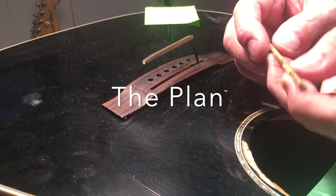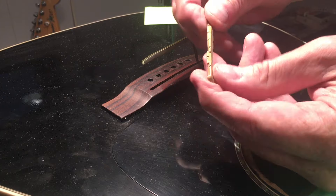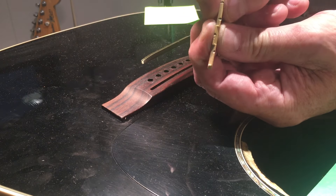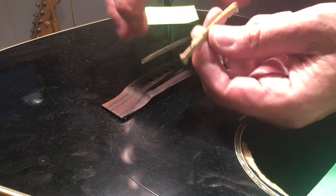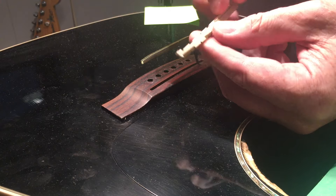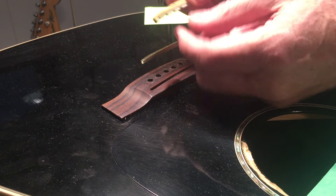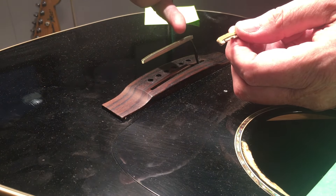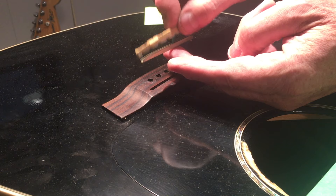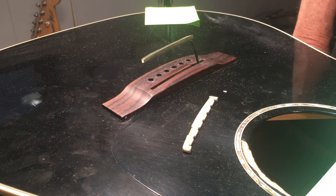The plan is I'm going to fashion an equivalent saddle that will have the same width, depth, and basic dimensions, and mill out a void equidistant on both faces at the bottom. The idea is to create a bottom slot that will fit the carriage. Yes, it's a pain in the butt, but it's problem solving — and that's what this video is all about.